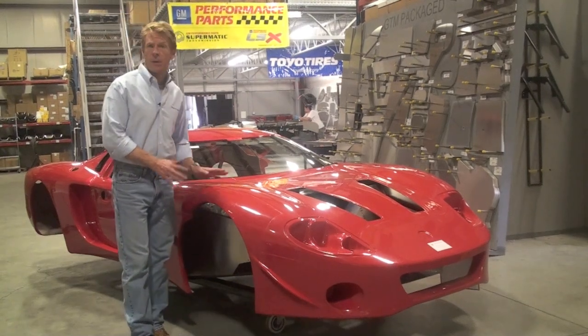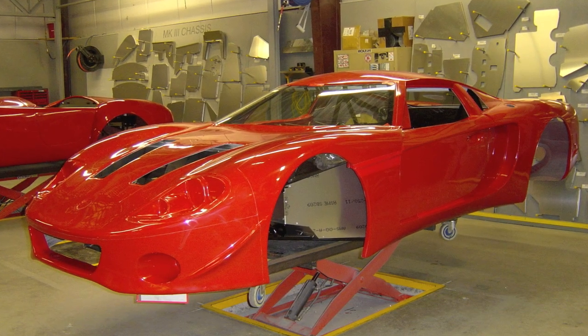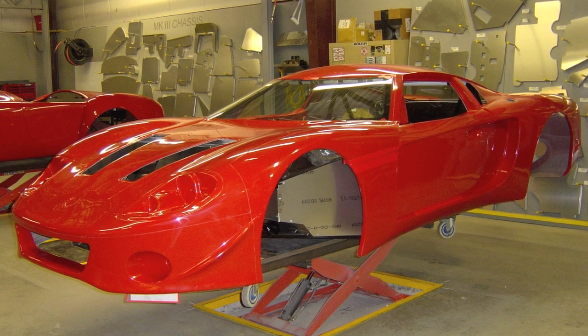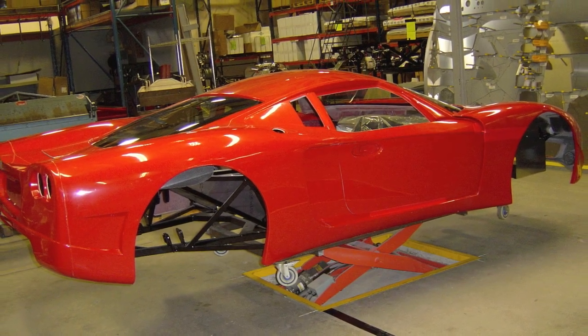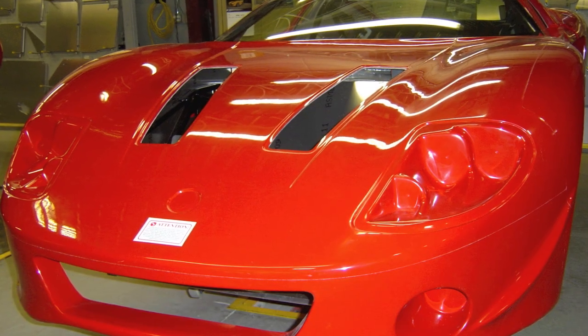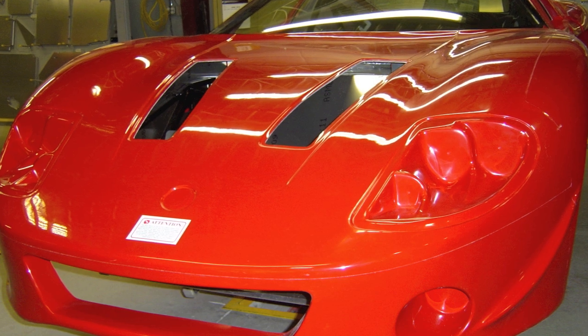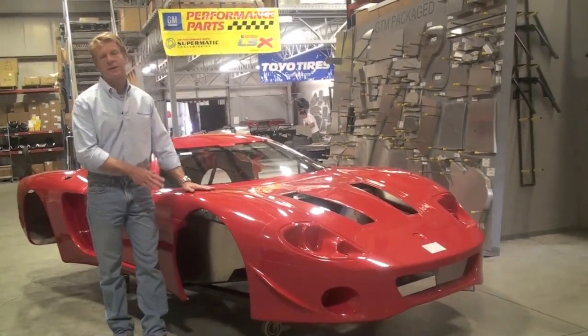The first thing I'm going to talk about is the bodywork side and the body shape. This is where most of the changes were made. One was on reducing cost. So we went to the Mark IV — like our Roadster was changed to the Mark IV — went to new expensive molds and a different laminate schedule, which is really a red gel coat. These are tight tolerance molds, and that means the car requires less bodywork.